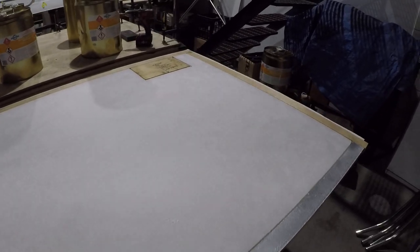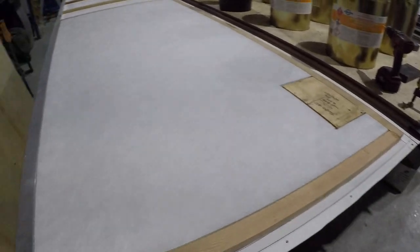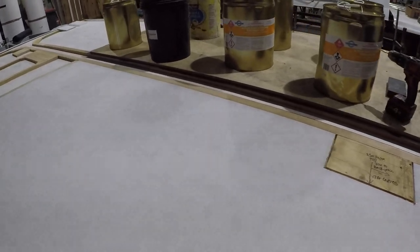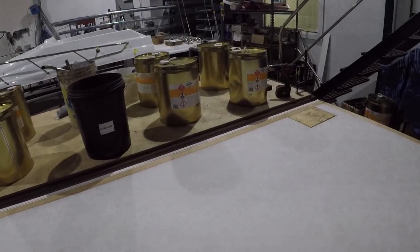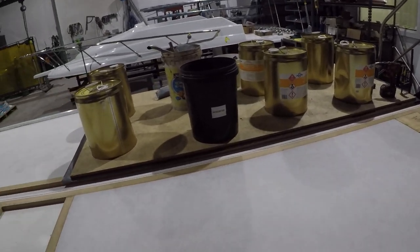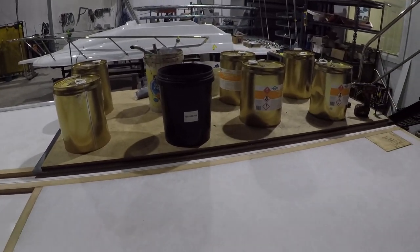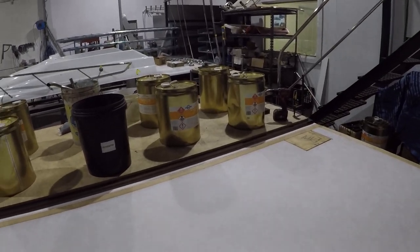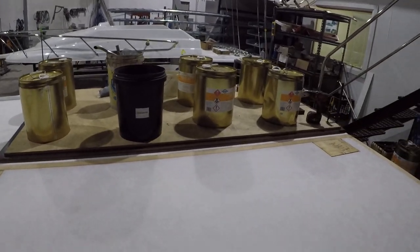This is the honeycomb panel - it's been glued down with vinyl ester. All of the cedar and the aluminium has been glued to the edge of the panels with epoxy resin, and then a vinyl ester resin to glue down the honeycomb. Over the other side you can see I've glued that panel down as well. There's a piece of chipboard on there that probably weighs around about 30 kilos, with drums each having about 20 kilos of water in them, just to give some weight to keep it nice and flat and make sure the laminate bonds well.